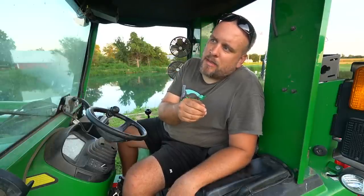Second reason is, to handle that creek, a brush cutter would be better than the flail mower, because a flail mower doesn't really mow in reverse, and I'd rather be cutting as I back up, going down into that. The last reason is there's something wrong with my tractor. Technically, there's two things. One of them is very minor. As I was trying to get the mower deck off, the tractor was running, and if I back up real quick, the last time I ran it, it overheated.